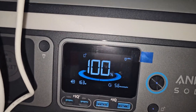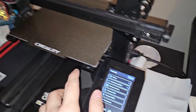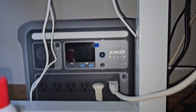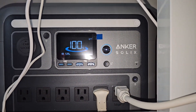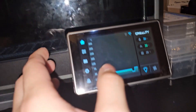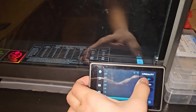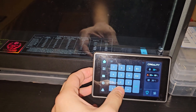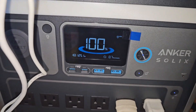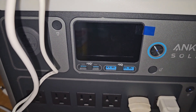Okay, everything is turned on and it's still working. I'm gonna preheat the bed and nozzle. Looking at it preheated to 500 watts - the CR6 SE uses about 500 watts. Okay, time for the K1 Max - let's do 80°C for the bed and 180°C for the nozzle.